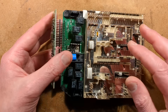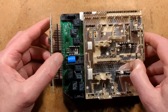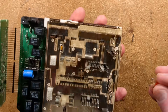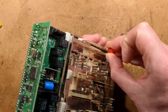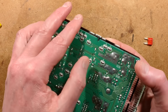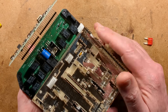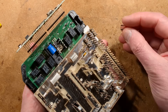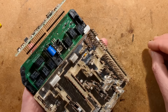Let's take a look at this circuit board. I get the feeling that a lot of the transistors in the back are for buffering inputs, but it's hard to see without reverse engineering the whole thing. The fuse holders are literally just punched metal strips that the fuses are effectively jammed into from above when you have the case on. It's also worth mentioning that some are not necessarily connected to things - they're shown as unused in the drawing. It makes me think of Eric's old video where someone had filled a vacant fuse position that wasn't supposed to have a fuse, and in doing so introduced a new problem.